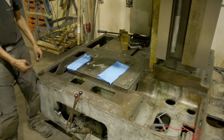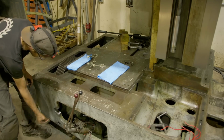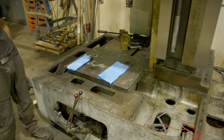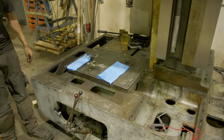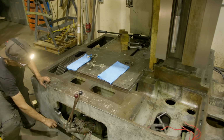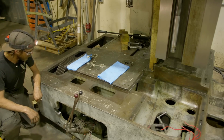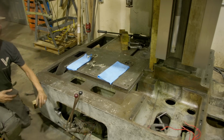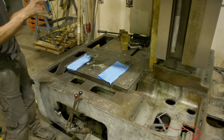So I'll be able to take a pipe and basically stick it all the way through and screw it into the gearbox, NPT, and that's going to work out really, really nice. I'm going to be able to come over here and basically undo a drain plug and drain it right here instead of trying to fish my way underneath. And that's important. At least it's important to me, especially since we did a lot here.